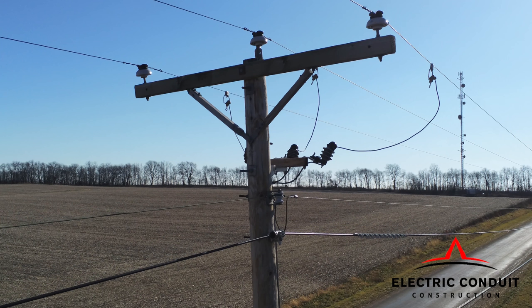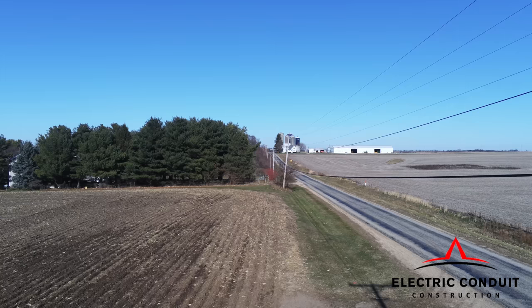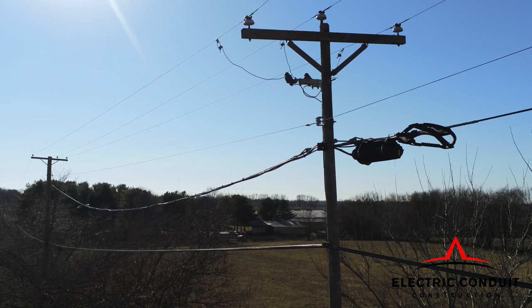In this picture, you will find a completed product. ADSS fiber installed within the tangent and grommet. All fiber is slacked in mid-spans. In this picture, a splice point has been established. Note the snowshoes, which create a slack to be able to have the case come to the ground and get into the splice trailer.